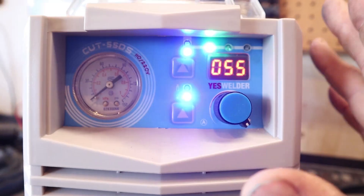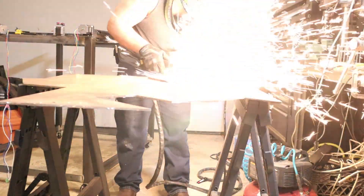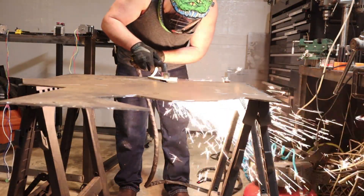So let's start off with the bad. Easily my biggest complaint about this plasma cutter is the instructions — they are not very good. The flip side to that is you don't really need the instructions, because this thing doesn't really seem to care what air pressure you set it to. I'm running it between 50 and 90 on the indicated air pressure on the front, with almost no issues. It doesn't really complain, and I'm cutting pretty thick steel — most of what I'm cutting is 3/16ths.